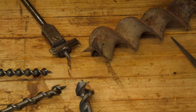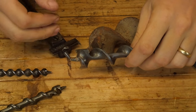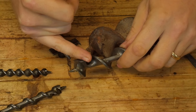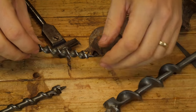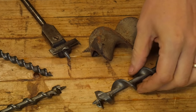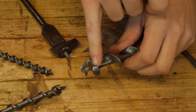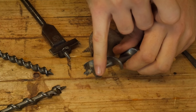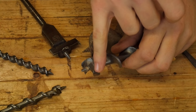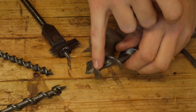The most common one you're going to find at a garage sale is this type. It has two blades but only a single spiral — one of the blades, the spiral stops at that point. Sometimes you'll find a double spiral where both blades have a spiral that completes all the way up the shank. These have a knife that cuts the hole and a knicker on the side that cleans it. The knicker is the very first thing to touch the wood after the screw, and it determines the diameter of the hole. The knicker scores a circle and then the blade comes through and cleans out that circle.